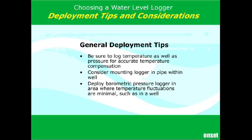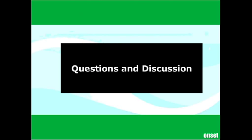We're opening up to questions. The first question is: are there special considerations for deploying a water level logger in shallow water, for example a tidal estuary? When I see tidal, the first thing that comes to mind is that you need to be concerned about corrosion. Depending on how salty your water is — that's a bit of a judgment call — you may want to use a titanium logger. You may also need to be concerned about biofouling, and may have to visit the site regularly to clean off the unit.